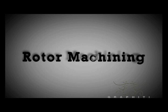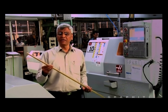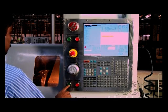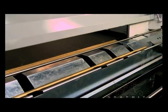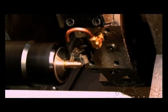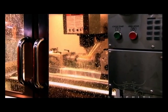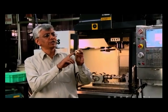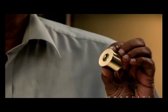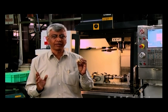Now the key making process is complete and it's ready for assembly. Our next step is machining these brass extrusions to manufacture the rotor blanks. After turning, the rotor undergoes broaching and is then further machined on the Haas VMC. Concurrently, the housing is processed in another cell, and then this housing and the rotor sub-assembly go for further processing to the surface finish department.